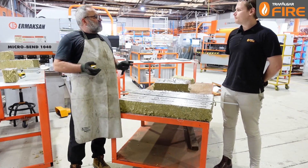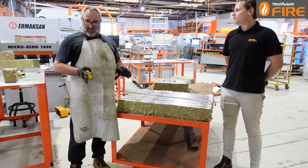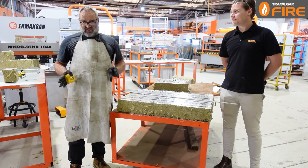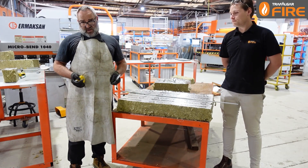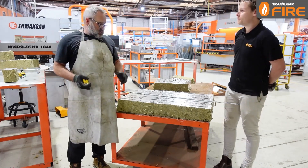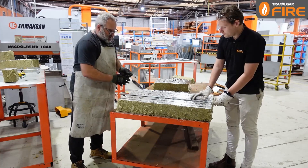Okay John, so we've got a 150mm gap, and we need 10% compression. Even my maths is good for that — 10% of 150 is 15 — so 165mm is the cut size for a CWFS 150mm gap. We've marked that up and measured it, and we've got a straight edge ready.